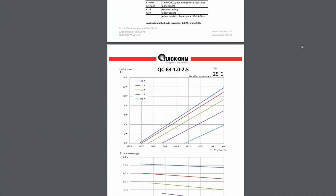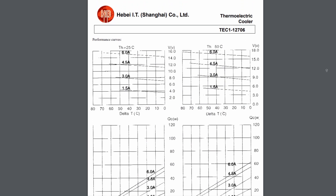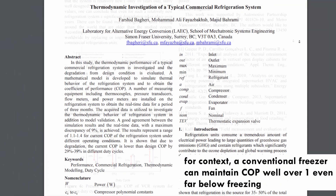You might think we just picked a poor example of a Peltier element, but that's not the case. This is the current state of Peltier elements. Find any other commercially available, practically usable Peltier element in this temperature range and you're going to find very similar, if not exactly the same numbers. Thermoelectric cooling systems at this temperature range with these kinds of temperature differences are just not efficient. They have practically achievable COPs that are generally less than one, if not significantly less than one.